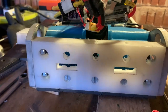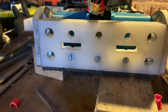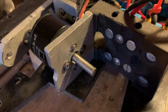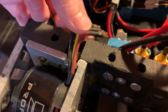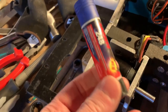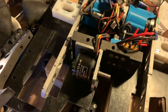Here's the rear of the robot now reattached with the bolt through the side. There are also barrel nuts in the bottom to hold the base to the back, and more to go in the top as well. The weapon motor is remounted against its plate to check it spins — all nice. The cables go across the notch at the top to keep them out of the way so they don't get pinched on the lid. Note: Loctite. The screws in the motor and most screws are Loctited in to make sure they don't move during operation.